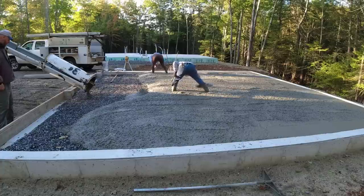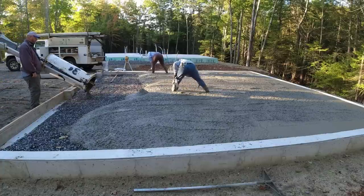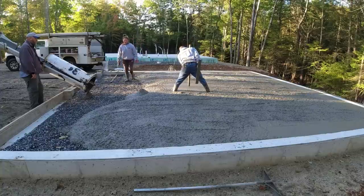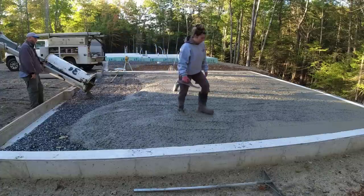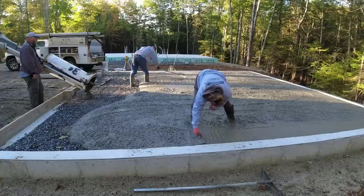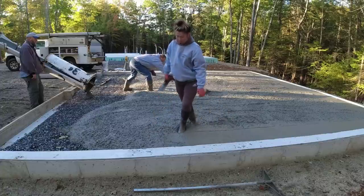What I'm doing now is shooting my wet pad in the middle. There are a bunch of ways I could have had this pad — I could have put a stake in there with a nail through it, but typically we don't want to hit or kick it. So a lot of times we'll just shoot a wet pad in the concrete like this. What I'm shooting for with my level on this pad is to make that pad exactly the same height as the top of the concrete wall. I've got it still a little bit high — probably three-eighths to a half inch — so I'm raking a little bit out.